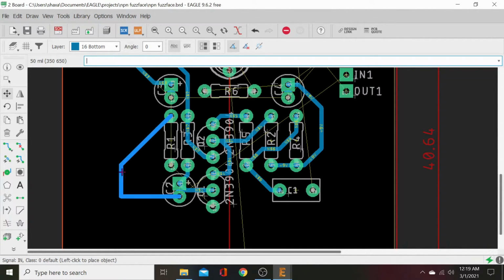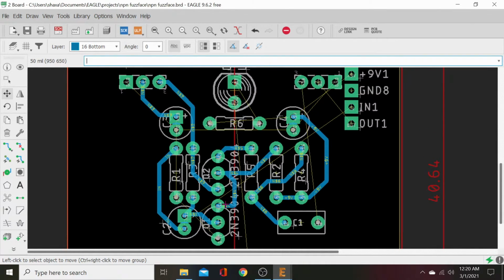Go ahead and move this trace over now. Angle this trace. We're just using the move tool here. Let's get that. Just using the move tool. There we go. We're moving what we've already got. And we'll get rid of that and get that off of that capacitor there, or that other leg, the ground, even though it's already showing that it's got a clearance issue. Let's check all of our other clearances.